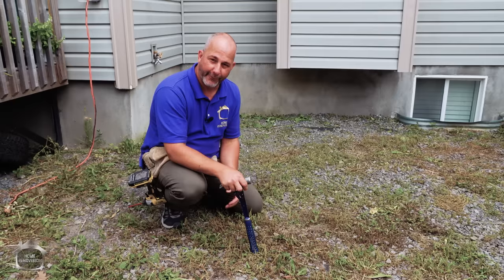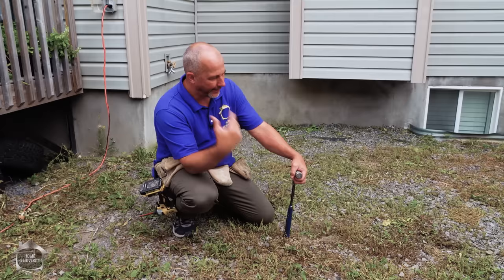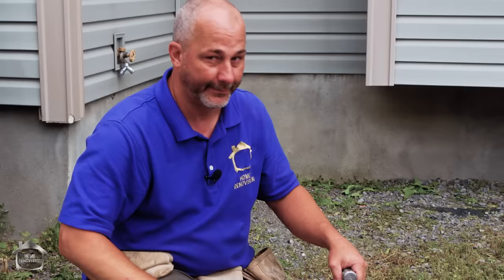Don't be too concerned if you have a situation like this. But for the most part, you want to put down some cloth — the thicker the better. The geotextile is the best. The thin light gray stuff will probably work as well. Lay it down before you build your deck and work on top of a clean surface.